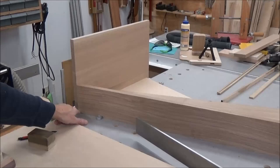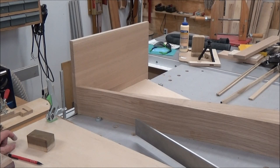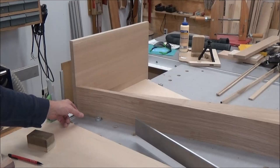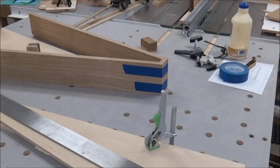After looking at this, I'm just going to run this all the way through and I'll plug these ends with some light-colored wood. I've got some scrap pieces I can use — make some square or rectangular blocks and just plug those in. It'll be a lot easier than doing it the other way, and it'll be easier to fit as well. I decided to tape this joint together temporarily.